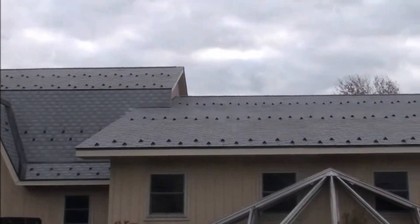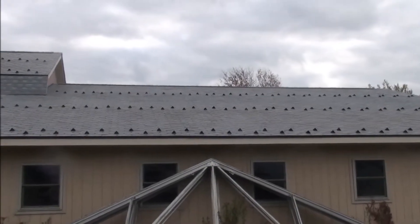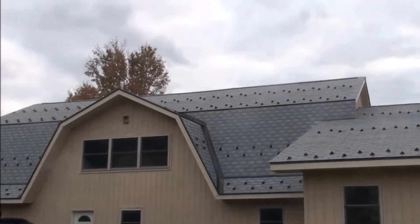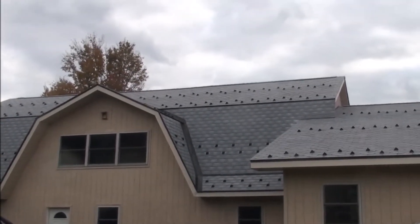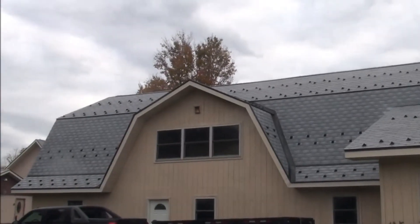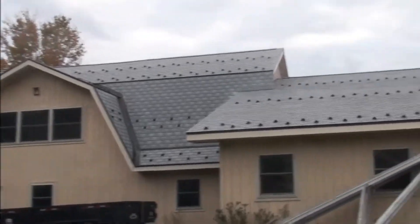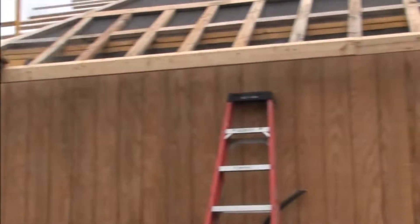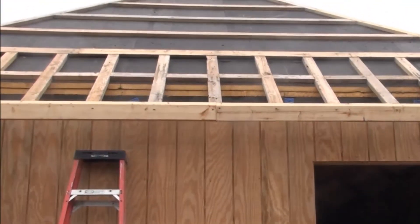I chose not to have it be too easy to slide off. As you can see on this roof, I have all these little obstacles sticking up which help to break the snow so it doesn't come off in a big sheet. When it came off this building years ago when I had an aluminum roof, before the gambrel end was put on where the office is, the snow would come off and darn near crush any vehicle underneath.